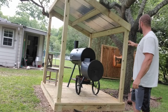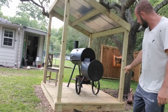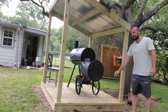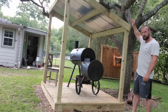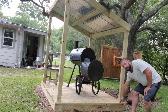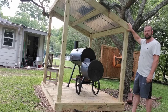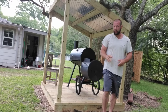Those are the dimensions. These are right at six foot because I'm six foot, so those in the back are just under six foot. Remember though, you have roughly seven inches you have to compensate for. If you want six foot of clearance, you've got to consider it's five and a half inches here and seven inches there. So don't cut this to six foot — you have to cut it taller, because if you want the bottom to be six foot, then from here to here needs to be six foot, not the total length of the four by four. You've got to take those measurements into consideration. If you want the height inside to be six foot, just the bottom measurement matters.